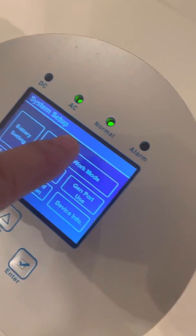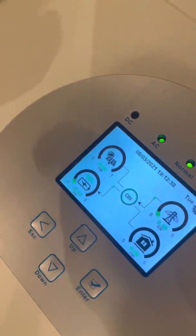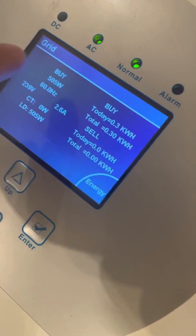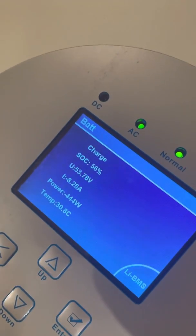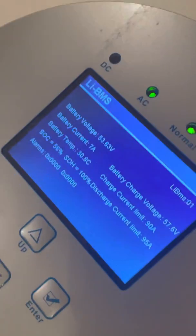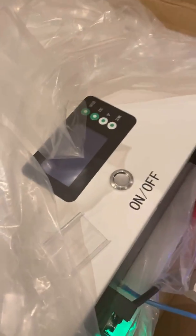Normal mode is on — as you can see, there is no problem with the system. Right now we are buying power because the battery is charging at 10 amperes. In the battery information screen, when you see a negative value it means charging; positive means discharging. The BMS settings show it's communicating with this power wall.